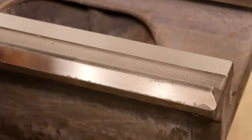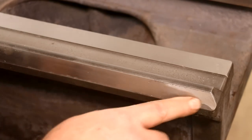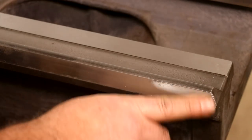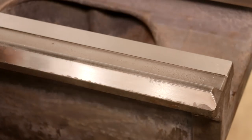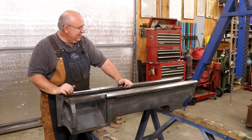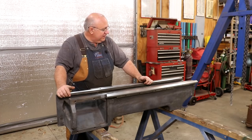There's another little spot back up underneath where the tail stock sits — I noticed there's just a small area in there that didn't quite clean up. But it's very similar to this; you've still got contact where it's going to make contact, you're just not going to have 100% contact. But on the headstock end, that's really immaterial. Well, there you go — a quick sneak peek at the awesome job done by Cache Masters up at Kinetic in the Milwaukee area on this lathe bed.